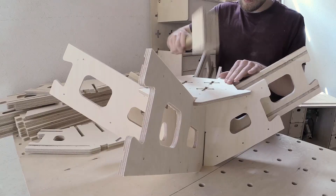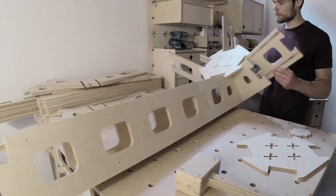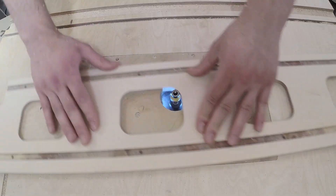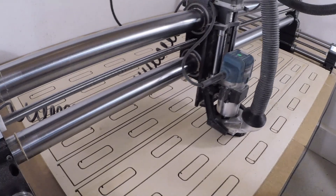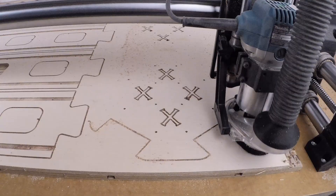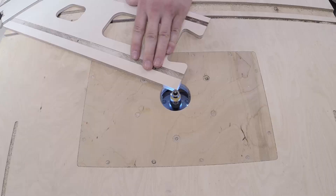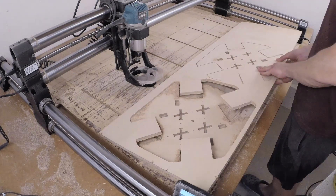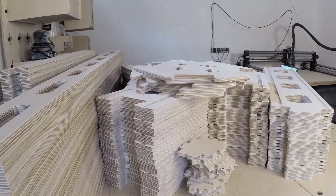I wanted to see how the parts would fit together before cutting all of them, so I assembled one of the corners, attached the corner reinforcements, installed the frame reinforcements, and added the frame sides. The assembly looked large but felt sturdy even without screws securing the parts. Since everything seemed to be working fine, I loaded the next sheet on the CNC and took apart the test assembly to trim the component edges. Making 190 components was a time-consuming process and I had a lot of time to think of things that could go wrong. My biggest concern was the ability to assemble the whole thing — I had somehow forgotten to think through the assembly process when designing the Urban Dice, and I knew assembling the large cube won't be as simple as putting together the prototype.